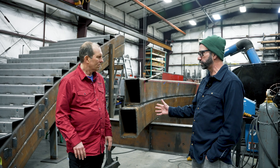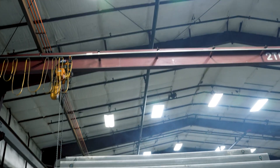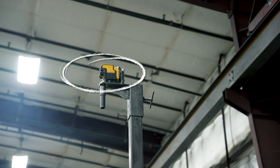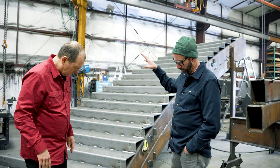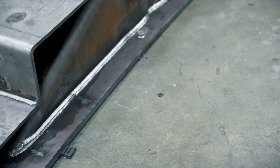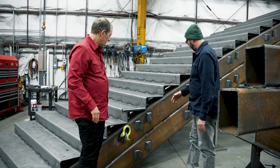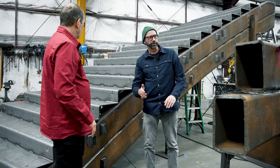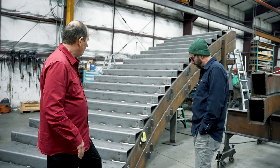It's definitely a team approach. Being a small shop, we only have a certain amount of equipment, so we definitely work with a lot of partners to pull off the things that we do. When you set this up in your shop, you found the center point, set a laser over there, and everything is working off of this — so it really enables you to grab good measurements. We actually used our Leica disto here. We projected the points and marked them out on the floor. That's how this base plate was located and anchored to the floor. All along here, these individual points were projected by the laser machine, and we utilize those so that the face of each tread is plumbed up right there, and then it radiates off of the center point, which is over there.